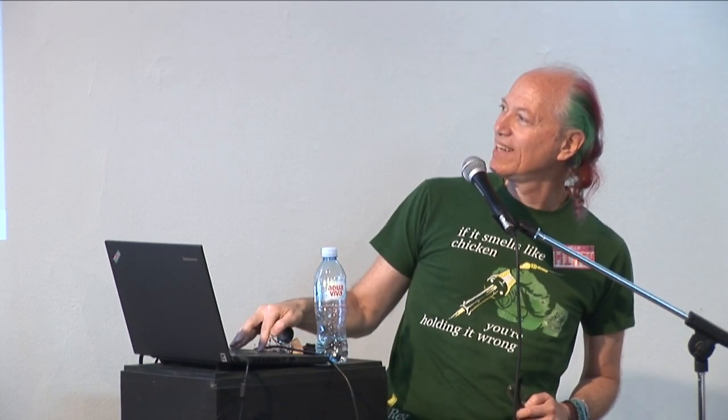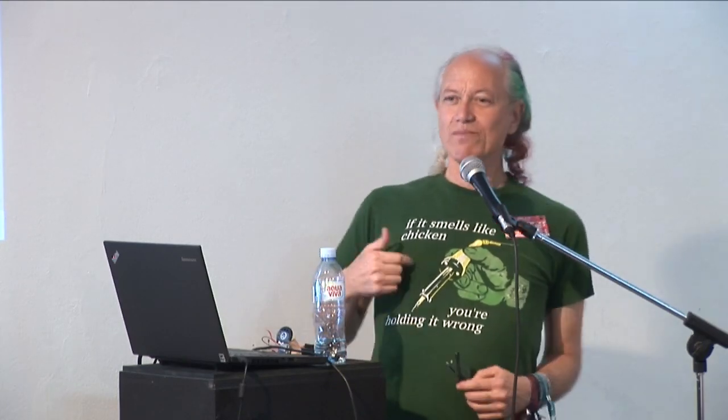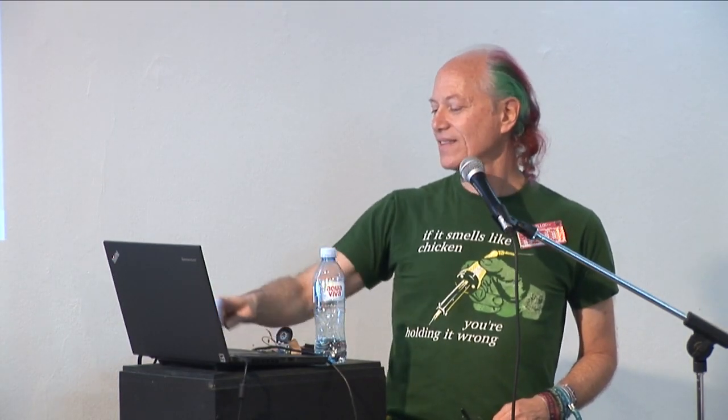So this line right here, pinMode, parentheses, LED, comma, OUTPUT, parentheses, semicolon. Okay, that's bizarre, but that makes the LED pin, which we defined up here as pin 13, that makes pin 13 an output pin. Okay? So let's say I wanted to hack this program, and instead of pin 13, I wanted to make pin 2 an output pin. What would I do? Yeah. So I could just come here, and rather than 13, I can just change that to 2.